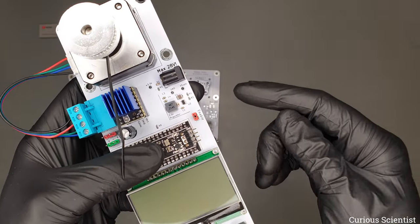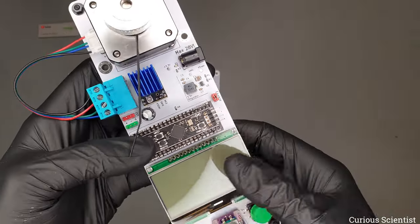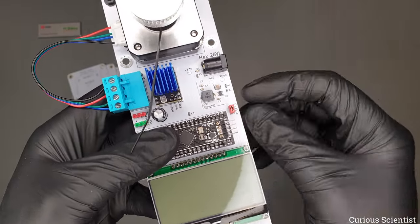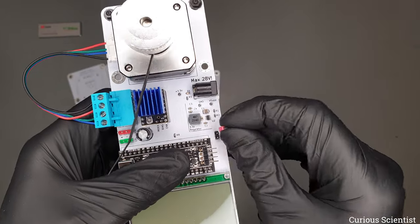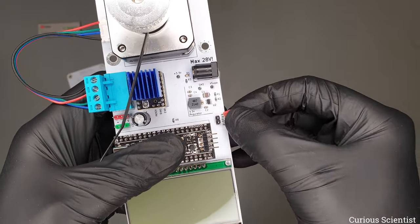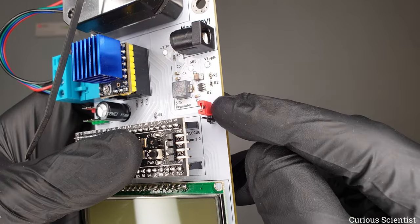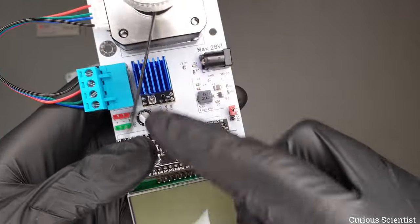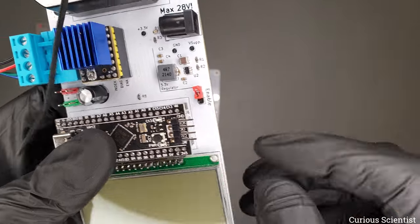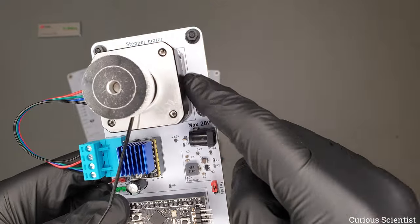But then you don't want to use an external power supply to supply the 3.3 volt components and also supply the 3.3 volts via USB, because that would lead to bad things on your circuit. The magic smoke would come out. So then you can cut off the 3.3 volt and just leave it as it is. So now I'm doing that. So now the output of the regulator is not connected to the rest of the circuit, but you have to have a supply either by the USB or here by the 3.3 volt pin, and that will feed the AS5600